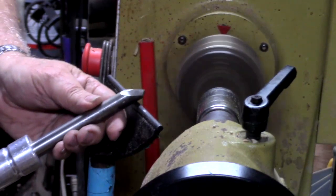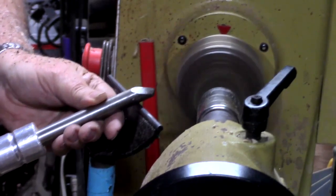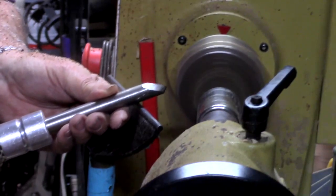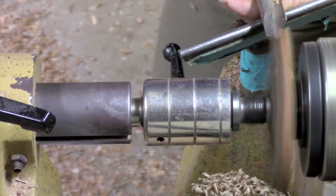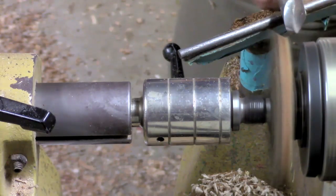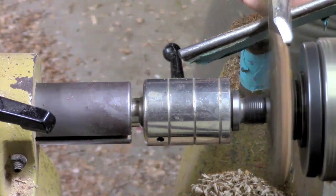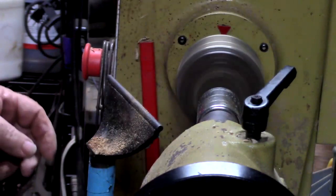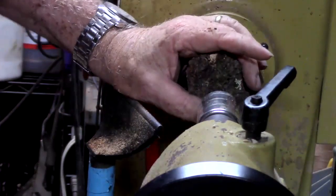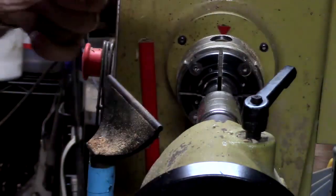If you want it round, now you're going to take light cuts here. Beginners out there and the folks that haven't done turnings like that, you're basically turning on a shadow line. That's what you're watching. We had a better view from the end stock than you might have from the top. I'm taking that wood piece off here, off the edge now. And don't grab this while it's turning either. Let's see, you could round it off like that. Have that as your roof.